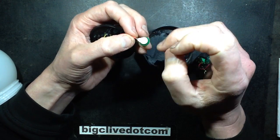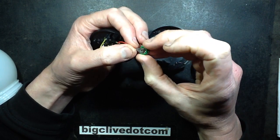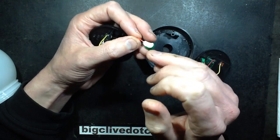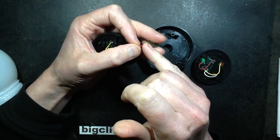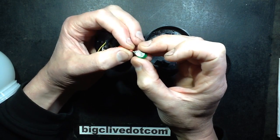Then it had just started doing the same to the solder on the connection. Because the stainless steel is quite robust as an electrode, it had eaten all the solder off - it just looked clean, as if there had never been a solder connection there, even though the wire had been soldered on before.